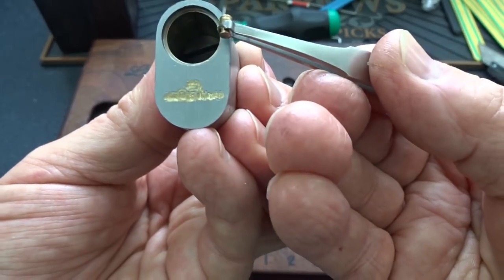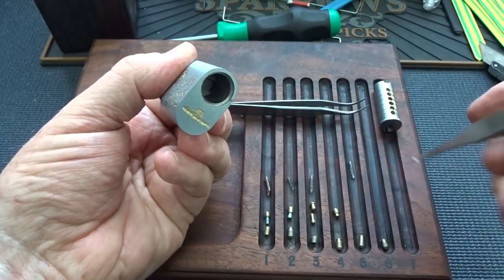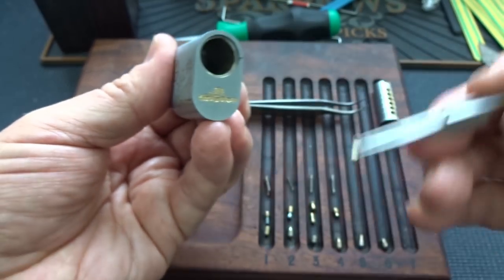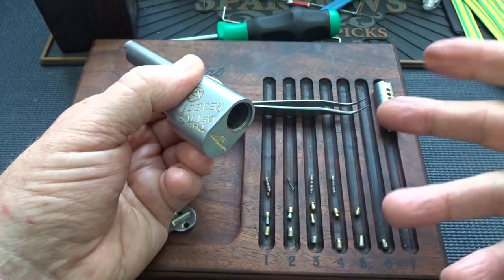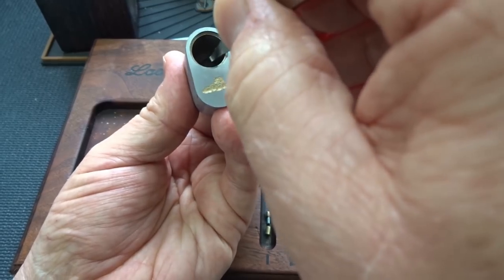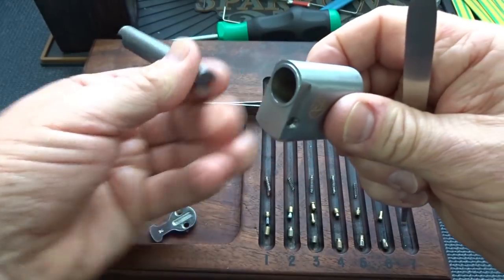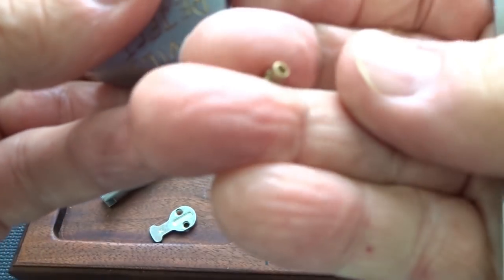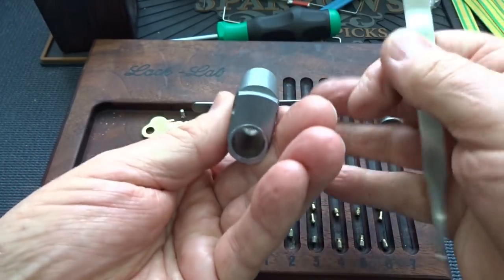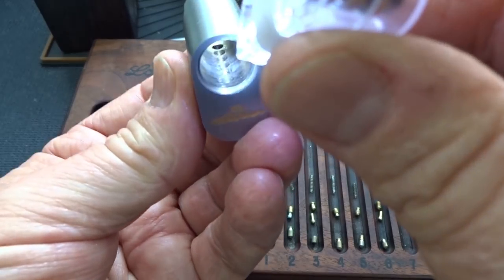I think it is another pin-and-pin — nope, it's just a homemade spool. Number five, again homemade, and he was in there like that with another tiny little spring — very hair-like. And the last one — probably going to be another pin-and-pin. He fell onto my finger right there. He's got serrated — so this is a moving sleeve with serrations. We had one with spools and then one with serrations, and a pretty strong spring in that guy. Very nice, very well thought out. Let's take a look inside to see if there's anything else.